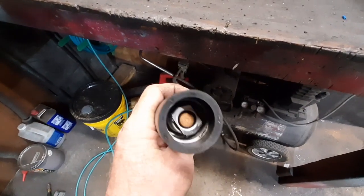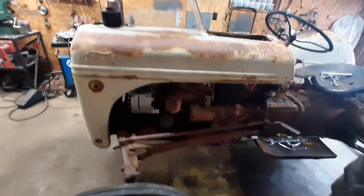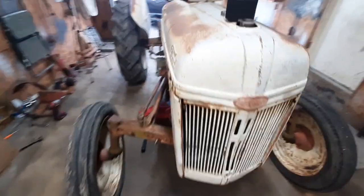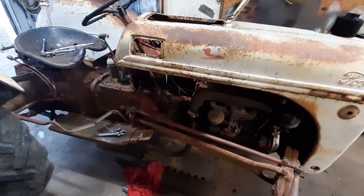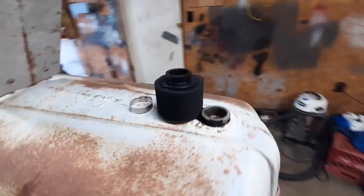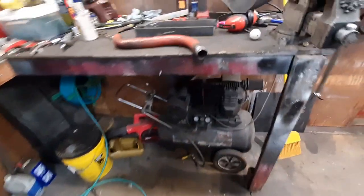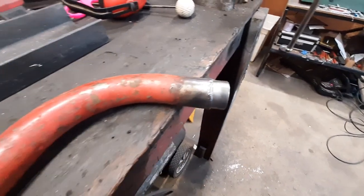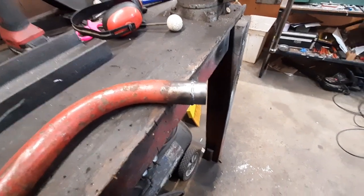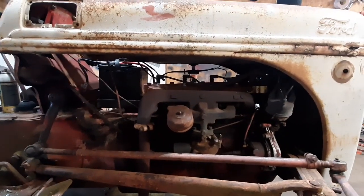There she is pushed in the hose — I don't see why that won't work, just slick. Alright, let's get caught back up. Got all the wiring done, tried it out. I went and put the hood back on, cut the old headlights off because they were crushed and rusted and in bad shape. One thing I still needed was an air filter, because I was not using the old oil bath. Got to looking through my parts bin, found a nice little foam filter for a motorcycle — the hole was just slightly too small for the pipe, so I cut a little bit off the pipe, sliced the side of it, squeezed it, inserted it in there, and welded it on. Now it fits nicely. I'll put this pipe in there with the pod filter tucked up under the cowl. I got a new piece of metal brake line and we'll run a new fuel line over. Now I need to tuck some wires up and we should be ready to put some gas in and see if it runs.